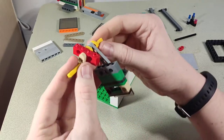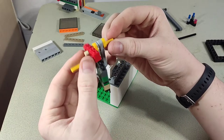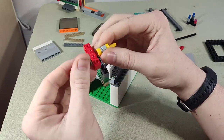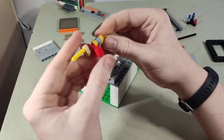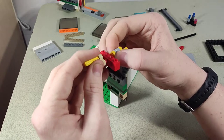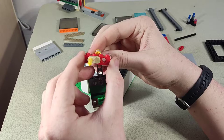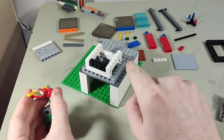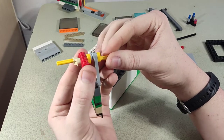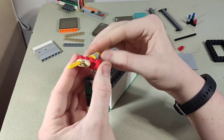It cannot go up and it cannot go down. If these two right here are in sync like this, it will not run. If they are 180 degrees offset like this, it will not run. If they are on the exact same plane like this, it will not run. So make sure your timing is like this. If you want to run in a clockwise direction, then do your timing exactly as I have it in this picture right here, or in this video. Just take a second to pause the video if you have to, but make sure you get your timing right.